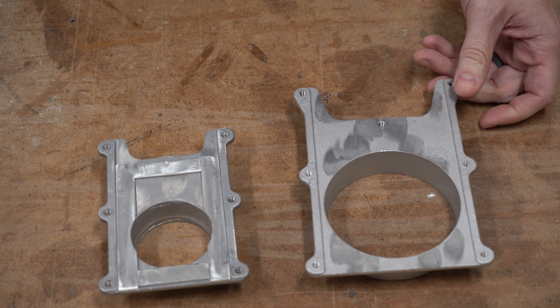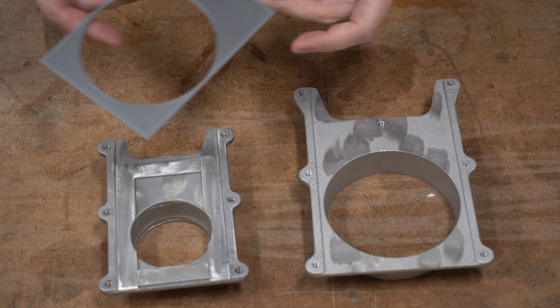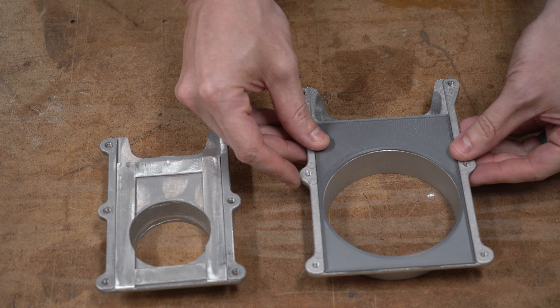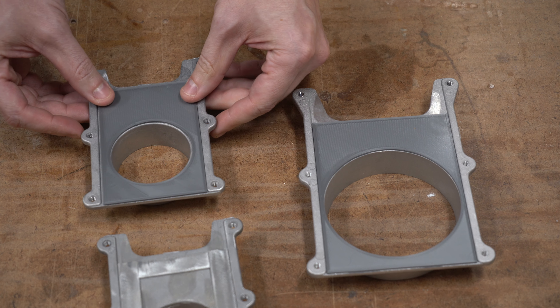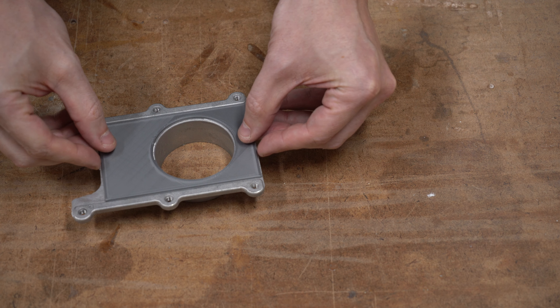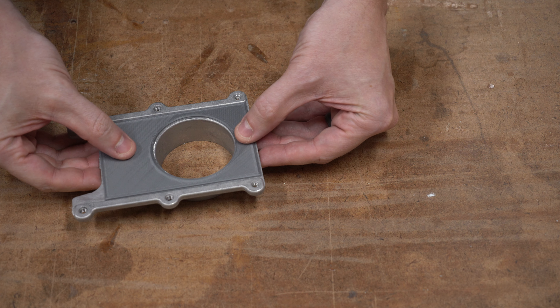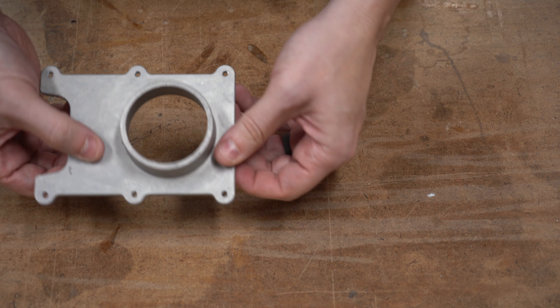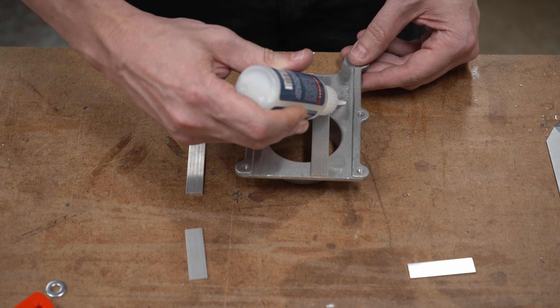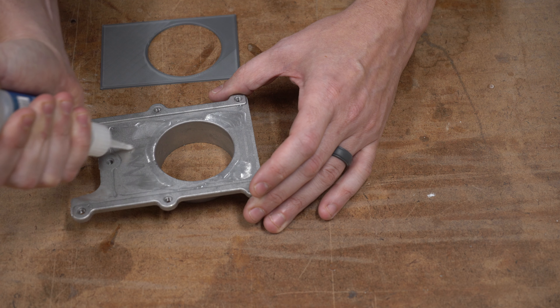And that's why I remembered I had a 3D printer. Now I know not everyone does, so you can easily go the aluminum bar route and be just fine. However, this was quicker for me, and because it's not structural, it'll hold up just fine. It also allowed me to make a perfect match around the hole and dial in the exact thickness I wanted. For both of these methods, I used medium Starbond glue to attach them to the gates, which was plenty strong since there wouldn't be a lot of torque on these surfaces.